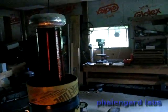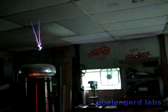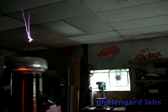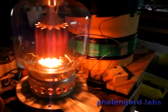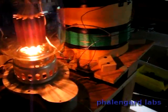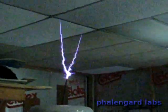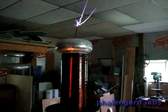And we draw about 10 amps, and we get 6 to 7 inch arcs. The plate is running a little red — it looks more red on the camera than it is in real life — but we're drawing a steady 11 amps at 90 volts in. And we also have the toroid there — it's not a little toroid.